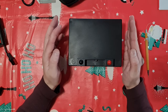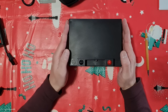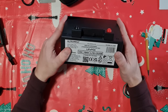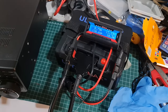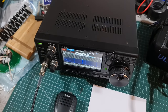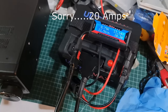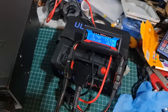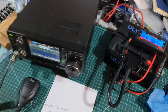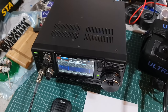I've done a couple of examples showing this in operation — I've powered my ham radio and also a diesel heater. The radio is the ICOM IC7300, which needs just over 20 amps to run at full power. This battery is capable of 25 amps continuous, which is why I've chosen it — there's plenty of headroom and I'm never going to need all that current. Typically when running single sideband I might only need 11 or 12 amps. The battery already has power poles fitted, which I've connected through my inline meter.